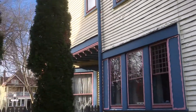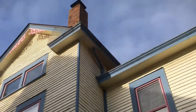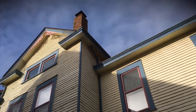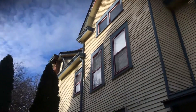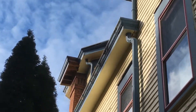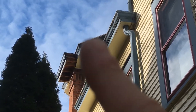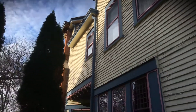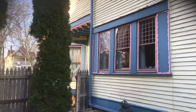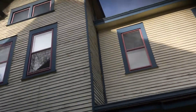Then you've got this side — the siding and trim, with a little bit more wood repair. There's crown molding up here that needs to be replaced, probably about a four-to-five-foot section. Above the chimney, you've got a little bit more soffit, fascia, and a little bit of crown molding that needs to be replaced as well. There's also substantial peeling in certain areas on this right side of the home.